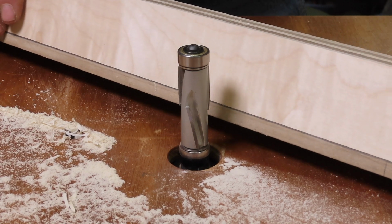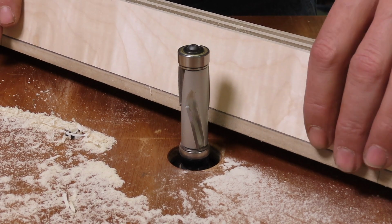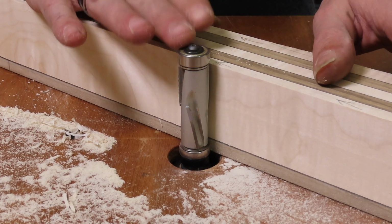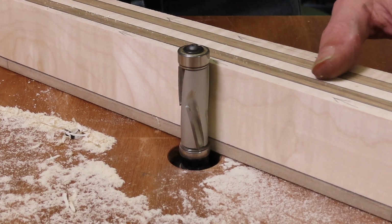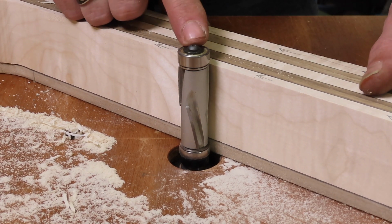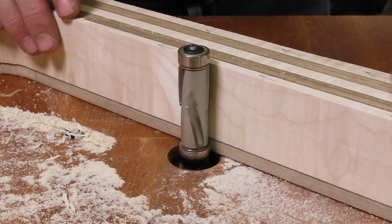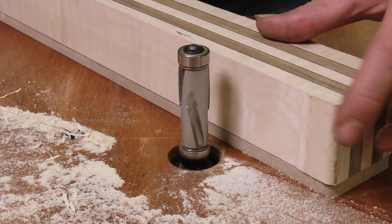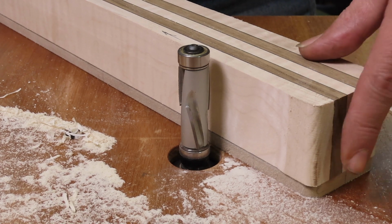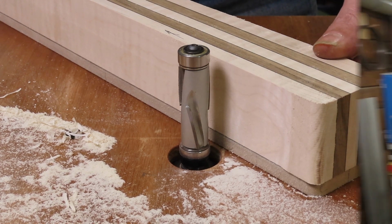A nice and smooth cut, and it takes a bit of practice, but it's real easy to feel the feeding speed you need for your router bit. Just start by applying a gentle pressure and you can feel how fast the router bit wants to go. This little piece we missed at the beginning will fix it when rounding this corner.